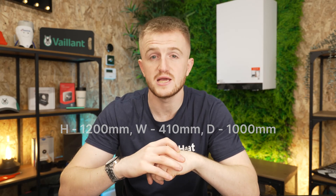This is so there's enough space for the engineer to get in front of the boiler, take the cover off and then drop the PCB down to work on the boiler itself. You get a seven year warranty through iHeat as standard. It's got a modulation ratio of 1 to 10 and of course it can be range rated, meaning the heating will be dropped down to a lower kilowatt which can save you money on your energy bills.